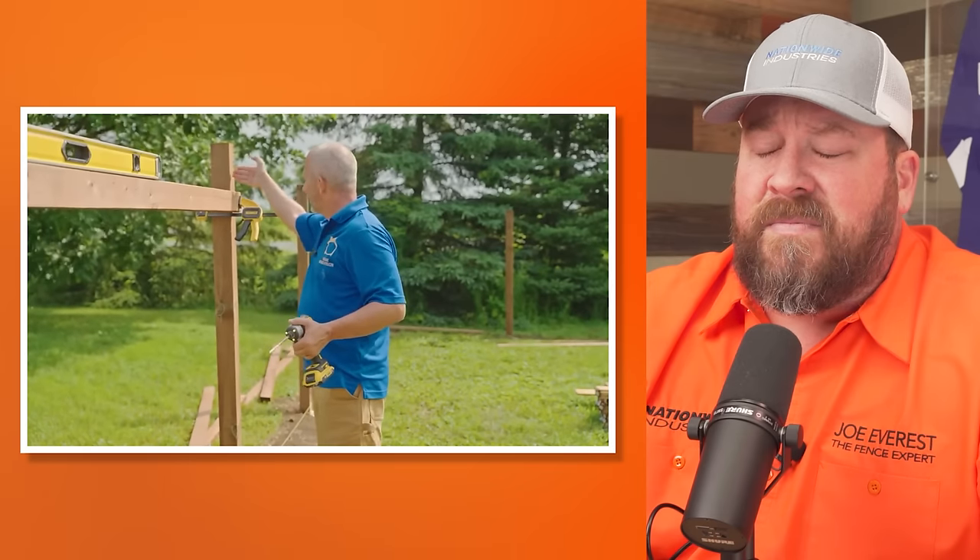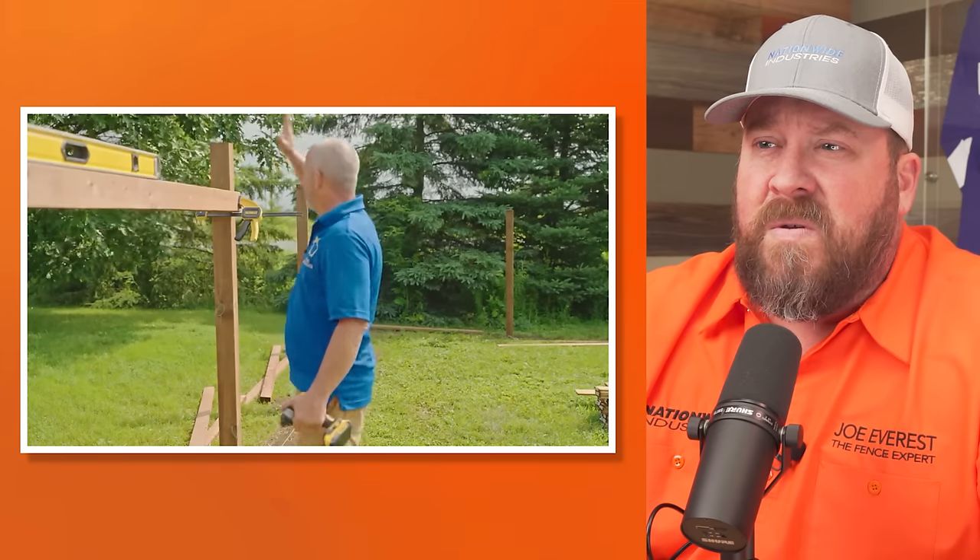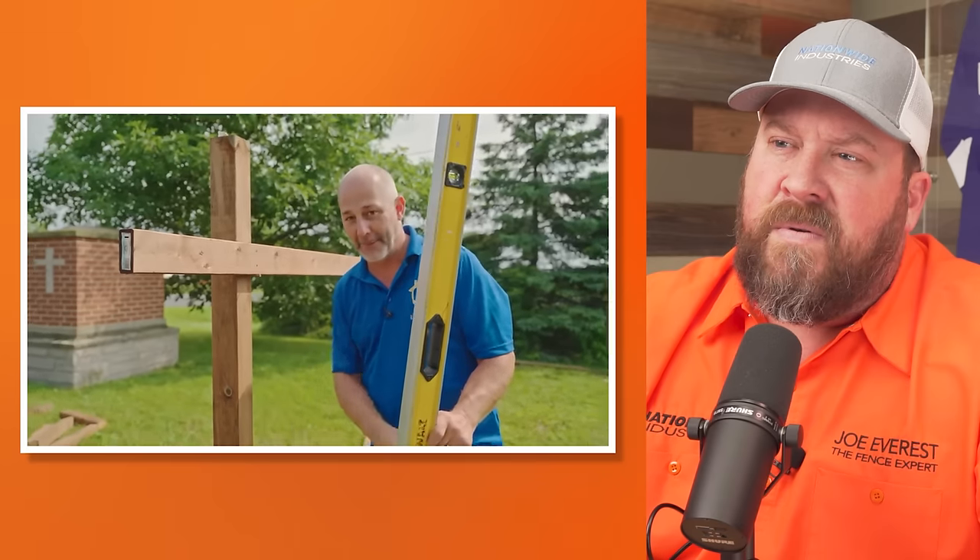When he puts his wood on the face of this post, the wind as it pushes against it is pushing directly on this post — as long as the wind is only ever coming from one direction. Maybe in his region it does, but we typically get winds from each and all directions throughout the year. In summer, wind comes from the south; in winter, winds come from the north. So you're winning one battle to lose the other. Just as long as you use strong fasteners, this isn't really an issue — the post is not going to snap in half because of the wind.